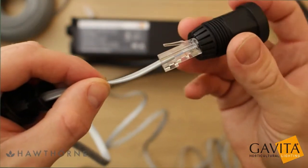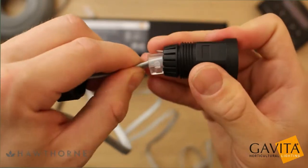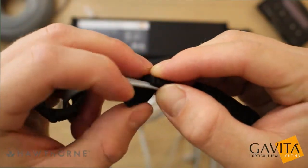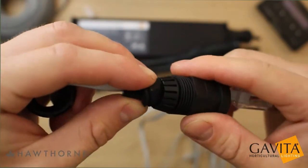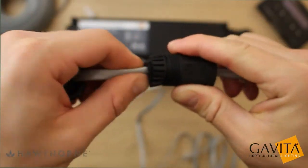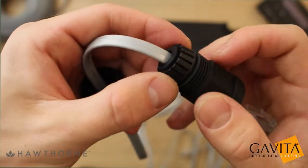With the plastic fingers going on first, slide the cable gland over the RJ45 terminal. Gently pinch the sealing sleeve so it wraps slightly — this will allow you to easily insert it into the plastic fingers of the cable gland. This part can be tricky, so don't get frustrated if it takes you a few times. After two to three of these you're going to be a pro. You'll know you've done a good job when the rubber gasket is flush with the fingers.